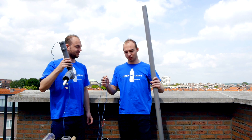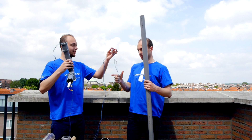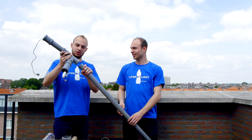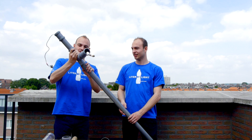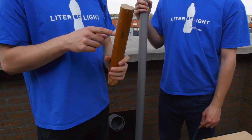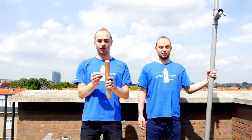After having our upper part, the next step is to start assembling the downward part. We'll need to take the long wire of two meters and a half and get it through our PVC pipe, the longest PVC pipe that we have. After introducing all the wires through this two-meter pipe, we just put our upper part, which we constructed earlier, and connect it. The next step is to have a bamboo that will serve for the stability of the streetlight. I carved it to fit the wires that will connect to the battery, and I drilled a hole where I put a screw that will also serve for the stability of the streetlight.